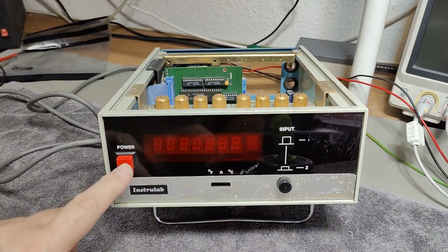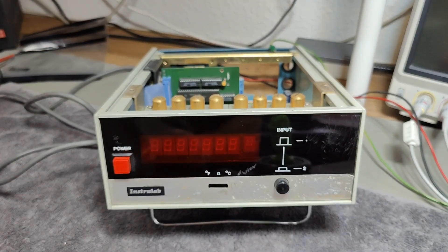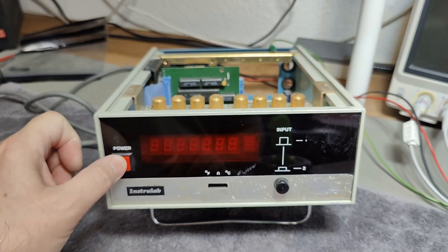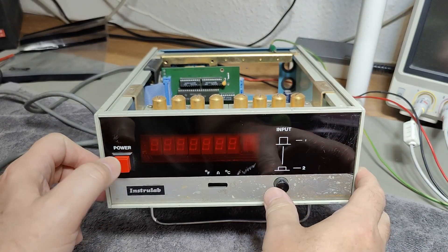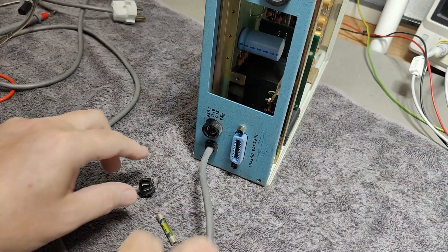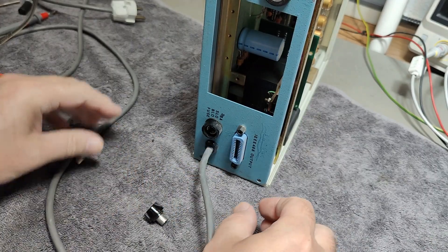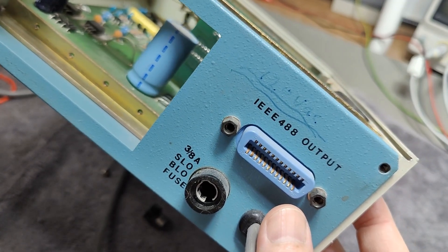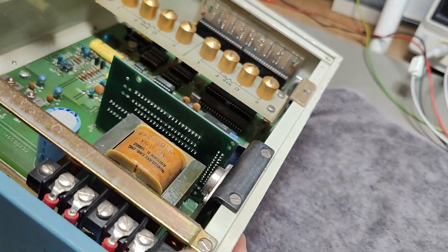So here is my first power up. This switch is, of course, out and let's not forget my little safety protection. I don't want to get hurt. So that is mains applied and we don't see any... oh, bummer. Maybe there's a reason why I got this one. That is not the most impressive start. Fuse is, of course, blown. And I don't know if you can see the text here — it says 120 volts AC. Bugger. Maybe I should try with 120. So this explains why the fuse is blown.